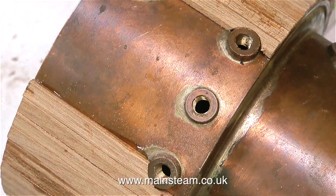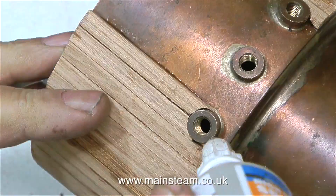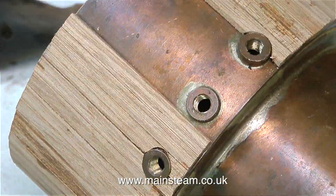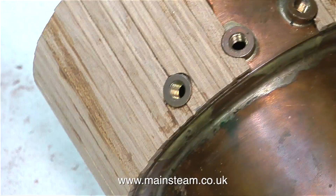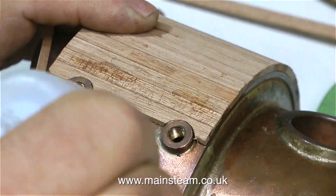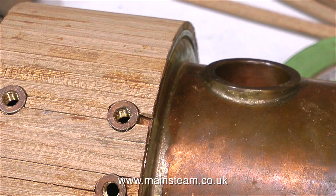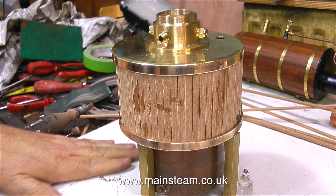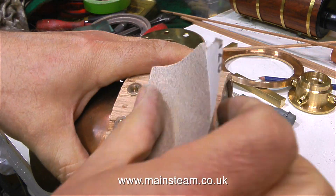I've already got round the other side to where there are quite a lot of bushes — these are the clack bushes. When the boiler bushes suddenly become in close proximity to each other, the job gets very fiddly. You put little pieces in, then another couple of planks, and another little piece. You have to ask yourself, how good do I want this to be? Well, I want this to be pretty good. Now you can see why I started the planking at the side of the water gauge bushes — because when I get right round the other side, the very last plank is thinner than the rest of them. This single thin plank is just behind the water gauge, which is quite good really — no one will ever notice there is one plank thinner than all the rest.